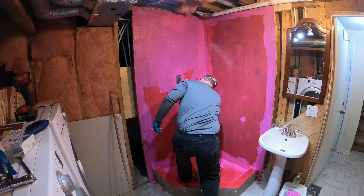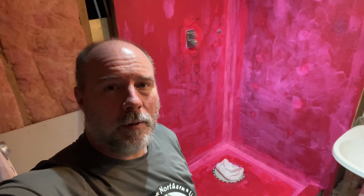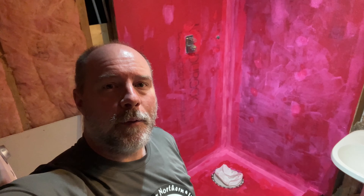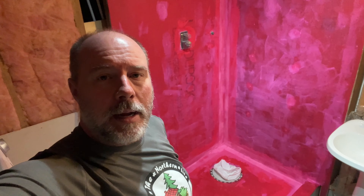So it's dry — I'm going to put a second coat on here again. That's where we're at in this process right now. We've got the Redguard going. It's got to dry for 72 hours before we can start to tile. After we tile, the thinset itself is going to take probably 12 hours to set before we can grout — let's call that 24 hours after we put the tiles in, then we can grout. The grout takes another three days to set. The grout we got doesn't need to be sealed, but we're going to silicone the big corners and the top and bottom around the base. That's what the professionals say, though we're not professionals.